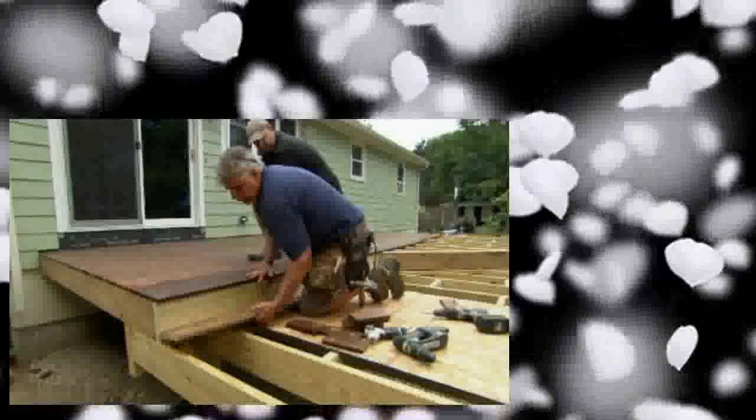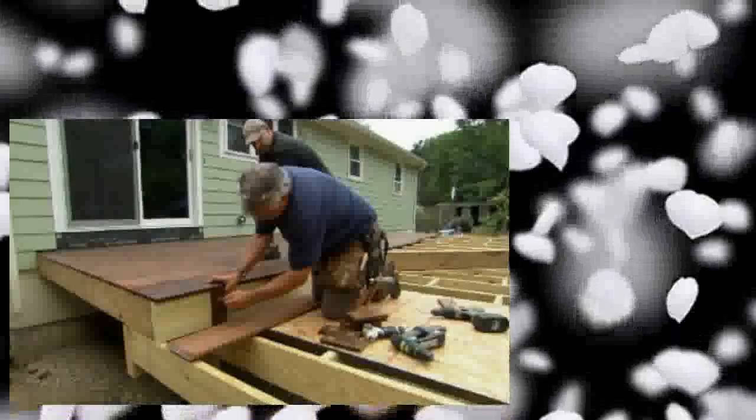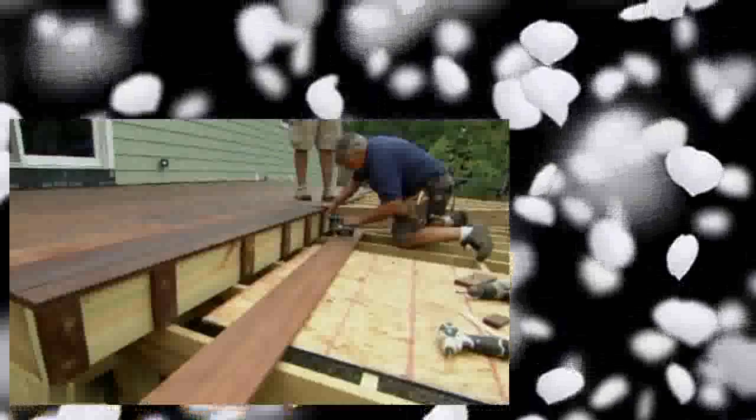Now the first thing I have to do is put a filler on the riser. And it just so happens that a piece of scrap wood works out perfect. So I pre-drilled some holes and I'll screw it in place. Now we mitered both ends of the 1x8 and we sealed the end grain. Now I want to hold it into position, keeping it flush with the top, lining up my outside corner, and I want to pre-drill for a screw.